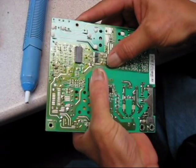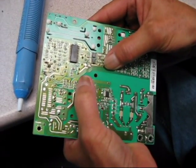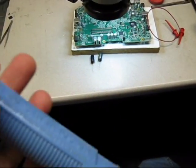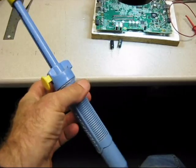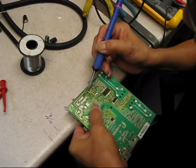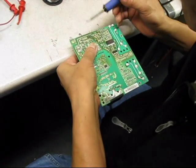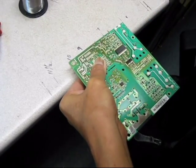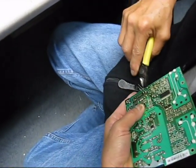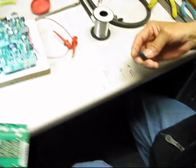As long as the voltage matches or exceeds the original — the originals are 25 volts — we're going to put 35-volt capacitors in, and that should do it. You'll need one of these solder suckers and a soldering iron. The second capacitor is being installed right now, and you'll trim the leads afterwards. On to the next capacitor.